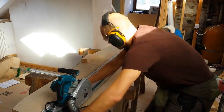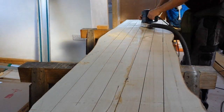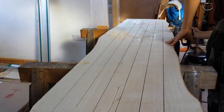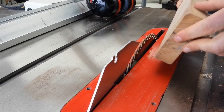I'm cutting about two thirds to three quarters of the way through the board, leaving about a quarter of the thickness. I'm just sanding the underside while it's upside down, getting rid of that glue line. We're back in the workshop to show you exactly what we're doing — it's quite hard to see with that big board.